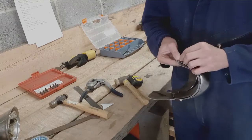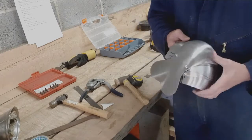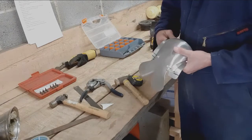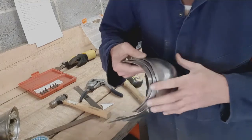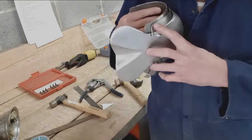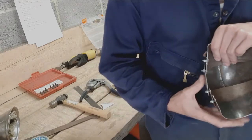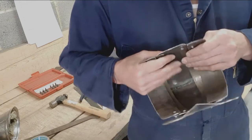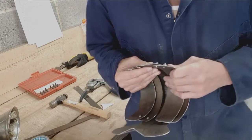It's well worthwhile having a good supply of these little bolts or other fasteners. The threads on them do tend to get damaged after a while, so they don't last forever. So that looks like that. And you can see here, that's that high on that side, and then only that high on that side, which means it's distorted that way, which you can actually see. If you look at that, you can see how that's kind of straight up there, and these ones are just twisted inward slightly. So I'm going to twist these outwards with some percussive maintenance, and then we'll go for the fitting.